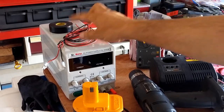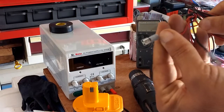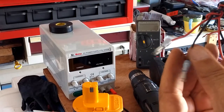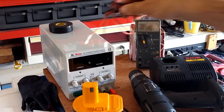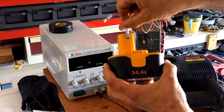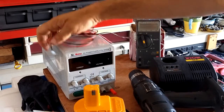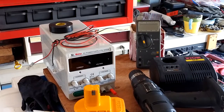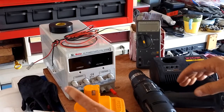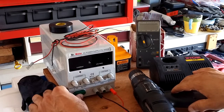What you're going to need for this is some electrical tape and some wires. I have a wire pre-made with spade connectors on the red and black ends, and these happen to fit perfectly on the battery contacts. You use electrical tape to tape them on in order to do the testing or the actual reviving. Just to show you that this drill still works, I went ahead and hooked it up to my power supply.